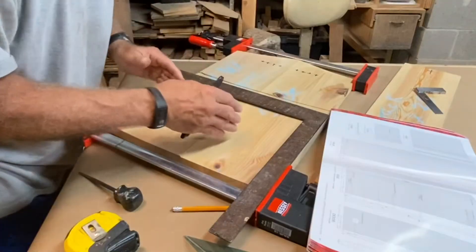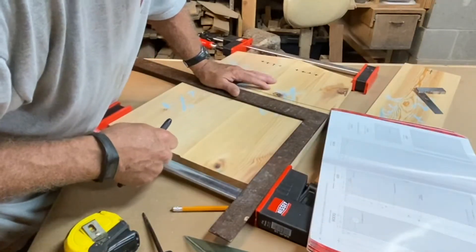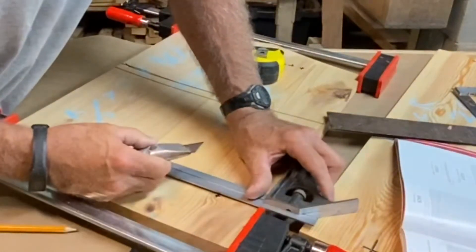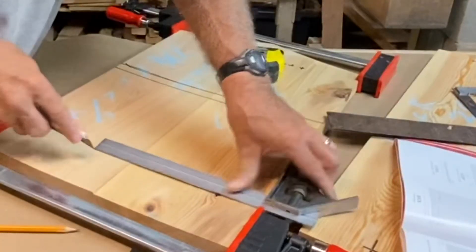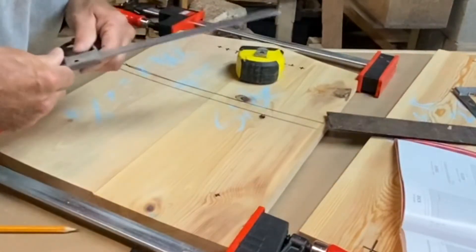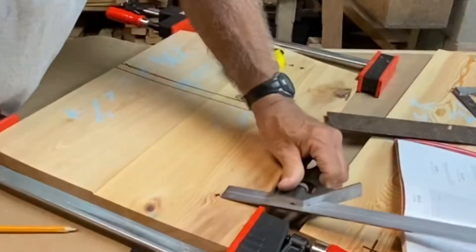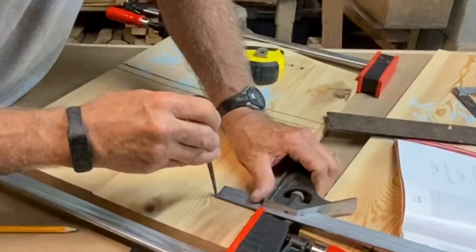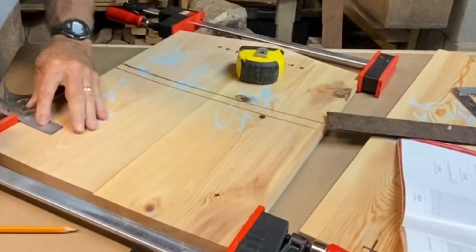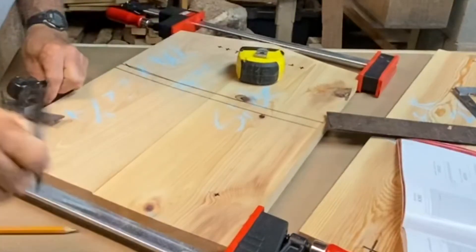This is for the floor. Now I need, for the roosting box down here — which is so much smaller than the one the Audubon Society had — I need three quarter-inch dowels. The dowels have to be very accurate because you're going to marry these two pieces together, and you want the dowels to fit, and they don't go all the way through. So that's it at two and a quarter. Transfer that line over to this one. And that is in two and a quarter, so I'm going to go ahead and set my tri-square at two and a quarter. Now I'm going to set my awl right in that hole, give it a little starter hole. Come over here on the knife line at two and a quarter — give this a hole — so I don't lose the mark.